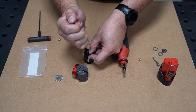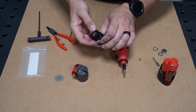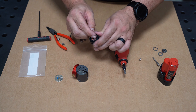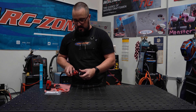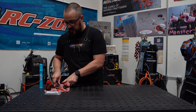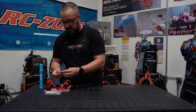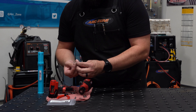This looks good. We're going to install our new — put the fiber washer on. So when you install the snap ring in this orientation, what you want to do is make sure you lay it flat on the upper body or the lower body, compress, drop it in, make sure it's all the way seated. You want to make sure it clicks and it should spin freely in there.